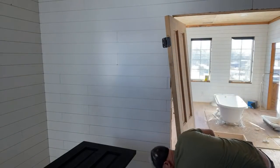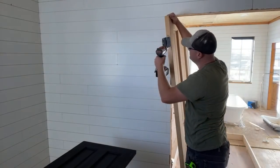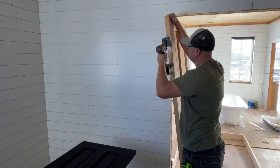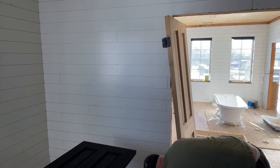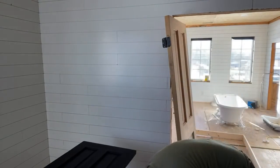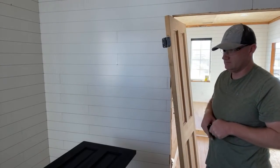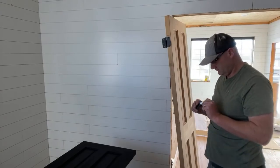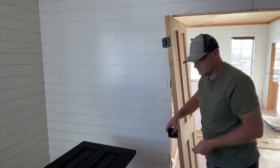Having solid wood doors also helps a lot with noise control. People were worried about us insulating, but we can't even hear each other without doors on right now. We insulated the bedroom wall all the way across and all the bathrooms. I asked my dad — when he built houses he didn't even insulate the masters, only the bathrooms. So if you have a track home and didn't pay for upgraded insulation, I guarantee the only walls with insulation are the bathrooms, and that's not even required by code.